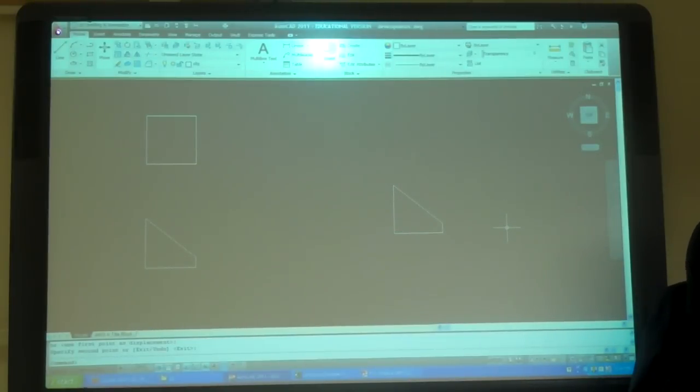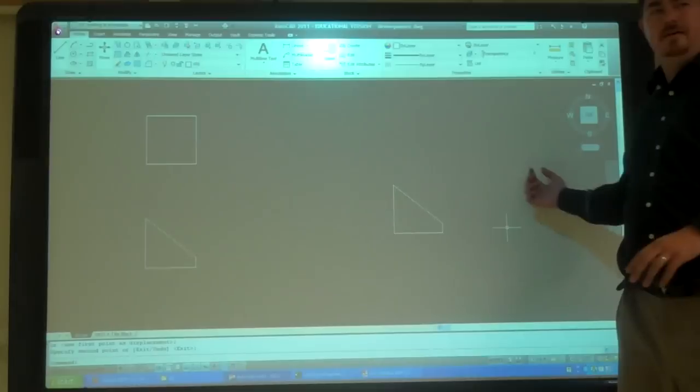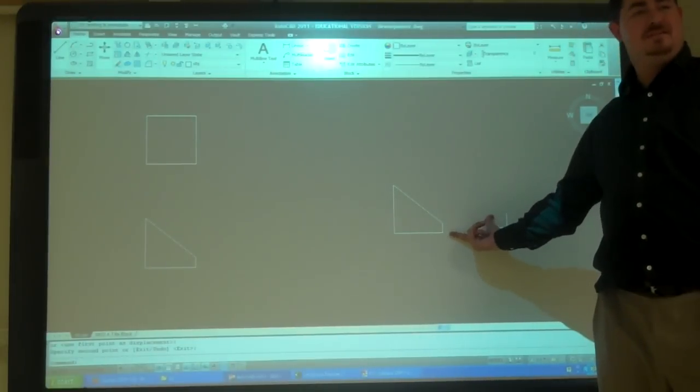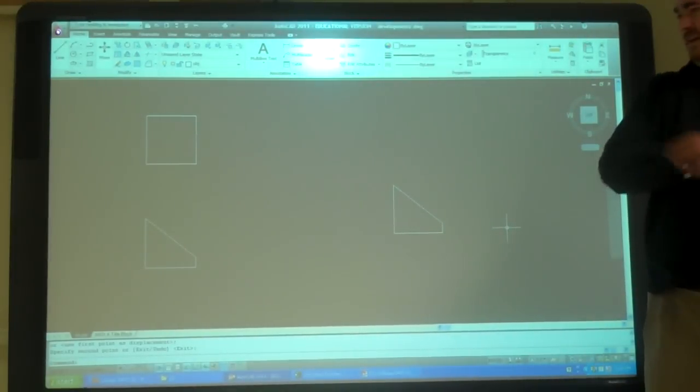So from here, what could be my next piece, the next face that I'm going to draw? Can you just do a mirror of the other side? Of that? Yeah, I can mirror this to get the other side, but how far away do I make it? Oh, you don't know that yet. Yeah, so we probably need to find that in between piece, either here or here first. Are there any other faces that I can see true shape?